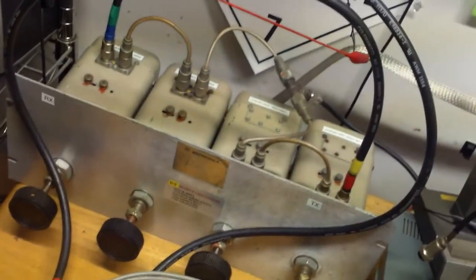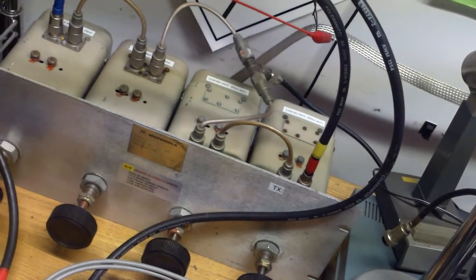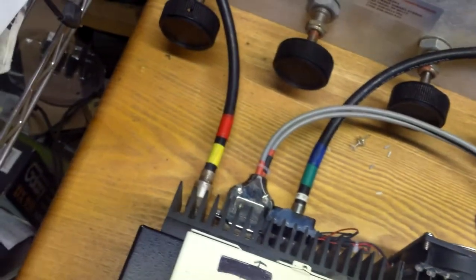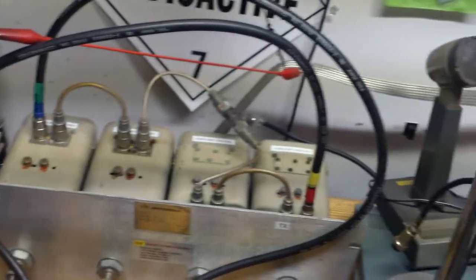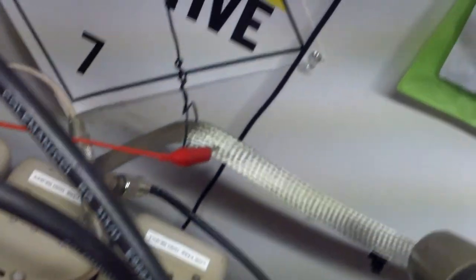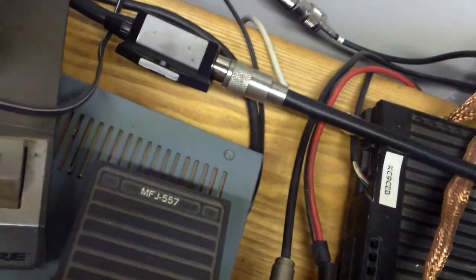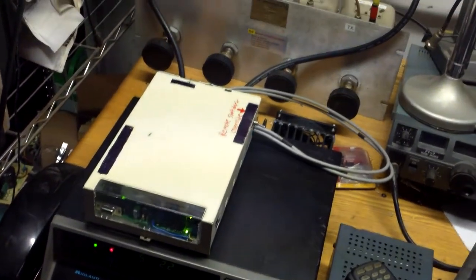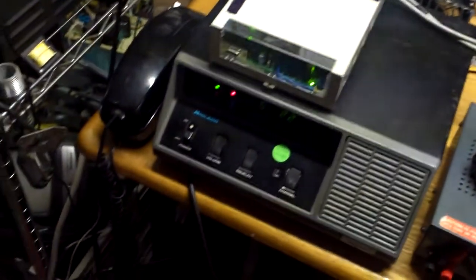Let me take you over to show you the repeater. Looking at all these connectors — only one from the transmitter on the far right is an actual silver-plated connector, and the other end of the transmitter cable. Every single other connector, including the one going to the diplexer, and then silver onto RG-213 up to the antenna with another silver-plated connector — so I don't really see the problem. The feeder works just fine with chrome or nickel, whatever they are.